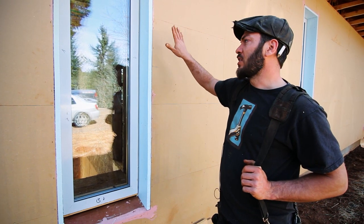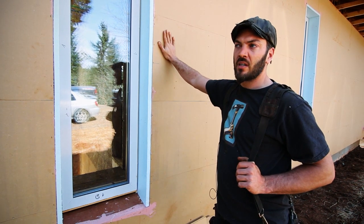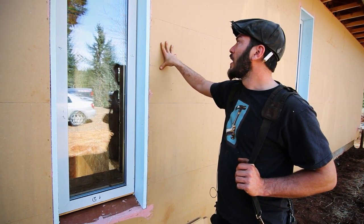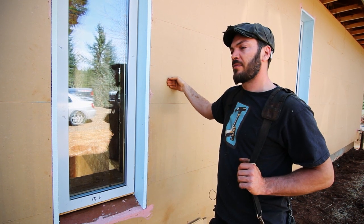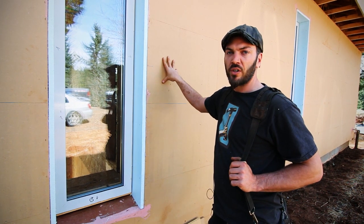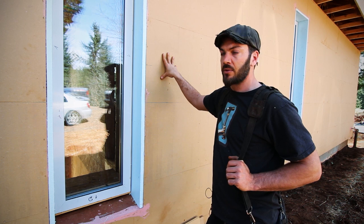The structure of our house is all back behind this — it's our 2x6 wall and our OSB cladding. This is all really just an exoskeleton created for insulation value. As we come out to this plane, we need a vapor permeable coating that will allow the house to dry to the outside, but still be rigid enough to hold in our 9.5 inches of blown-in cellulose.